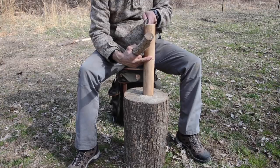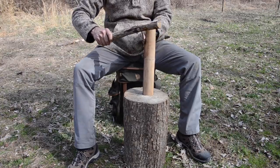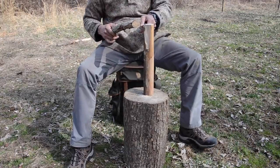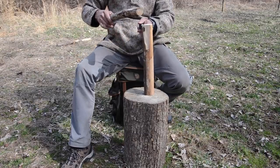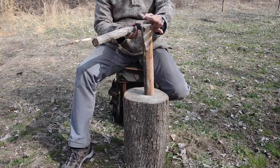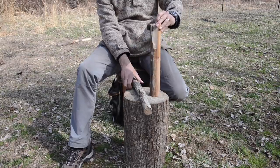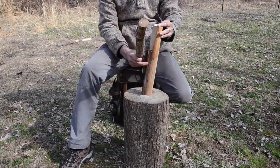I'm going to cut about that depth off and connect to those stop cuts. Whenever you're batonning on the edge it's going to have a tendency to run off, and that's okay. It's very important to pay attention to where you start those cuts, because where you start is the diameter you want it to end up being. It's going to run off every time, so don't worry about that — just keep going. You're just reducing the amount of material you have to carve off later.